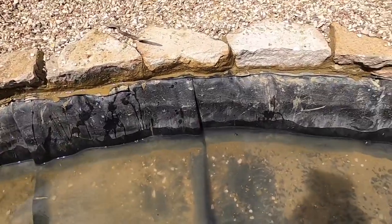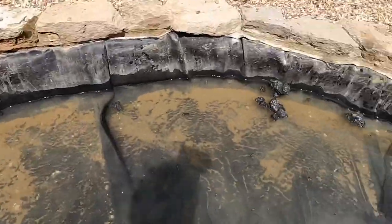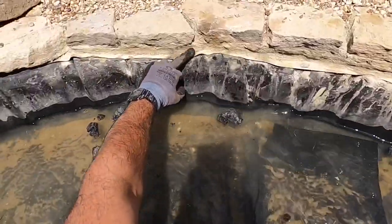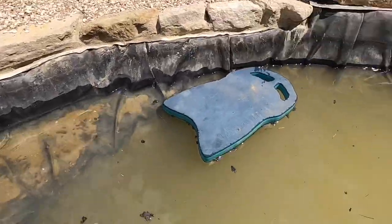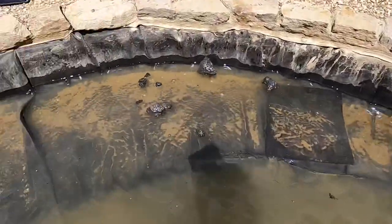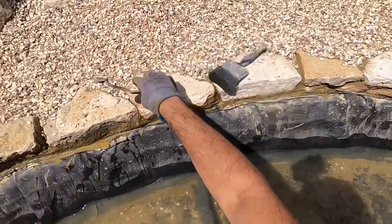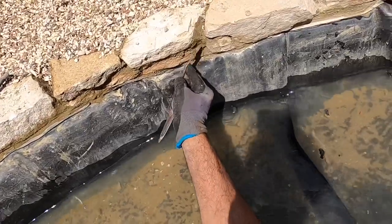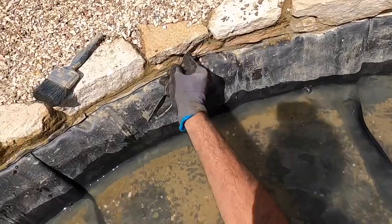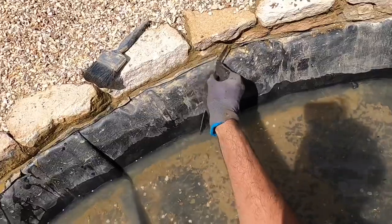There will be a little bit of staining on the rock - next week when I'm back I'll just give this a bit of a jet wash and a wire brush and that'll get rid of any cement stains. You can see this is the finished result - it's very rough and ready but it looks a lot more like stone underwater, and once it's got that natural patina of algae growth and discoloration it blends in really nicely. You don't want to attempt this until the mortar has had a bit of a chance of hardening - if it's too soft and you try and put moisture on there, it just ends up being a sloppy mess and not workable whatsoever.